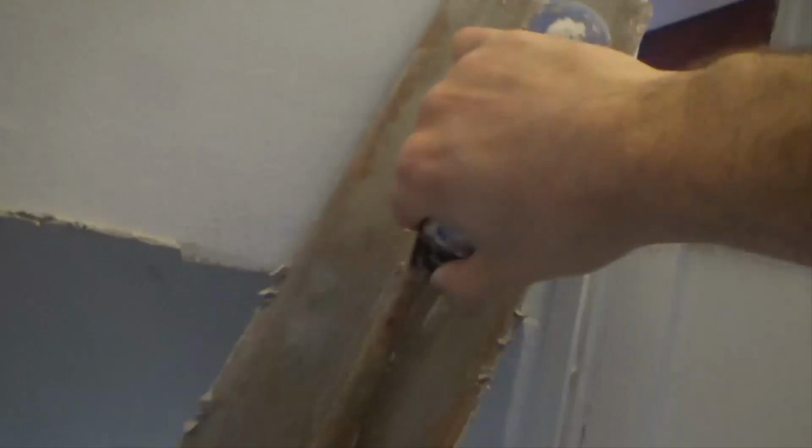it'll still scrape back, but it's firmed right up just the way I want it. So I'll show you now the way I go about these. Most times if you can, start at the far end, but on this occasion I can't. You'll always want to keep the back of the trowel clean so that the embeds there don't rough up the front. But we're going to trowel this again and tussle brush all this as if it was a corner.